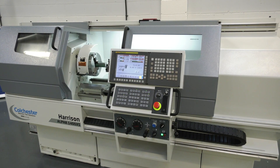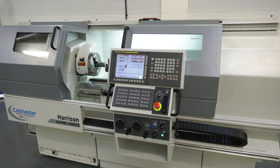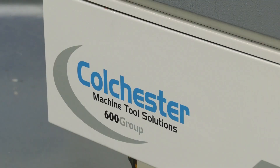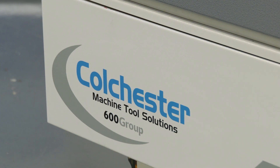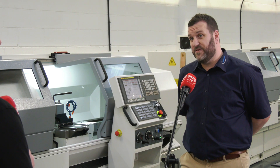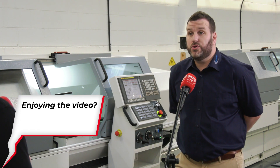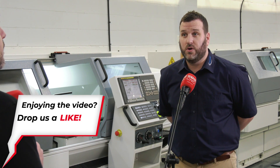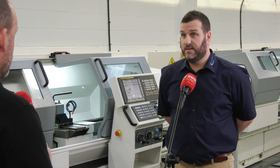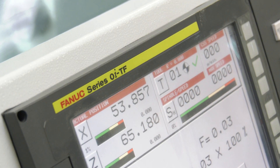And what were the reasons for you losing out to this? Is it because of what we've just said, or in addition to that, the other technical features of the machine? I think definitely for what we've said, but also that we do a turret version and a C-axis version. So you can do short batch work with some C-axis work on, which is fantastic. So you can mill on here as well? Yes. You can do your cross flats and so forth? Exactly.